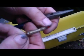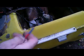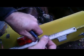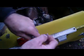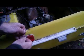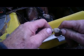This butt connector isn't covering that end of the wire very well — there's one butt connector removed. I'll cut this other butt connector out, saving the fuse holder, and cut this bit of wire back to just beyond where the split is in the insulation so we get some nice shiny copper wire. I'll dispose of these old connectors.